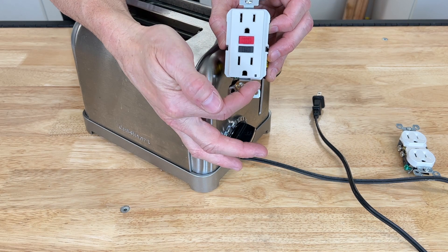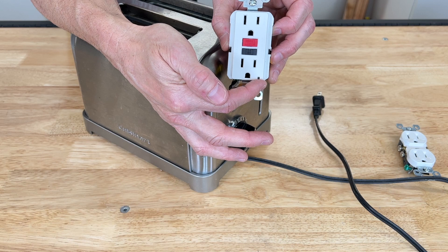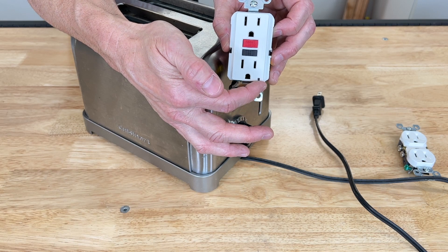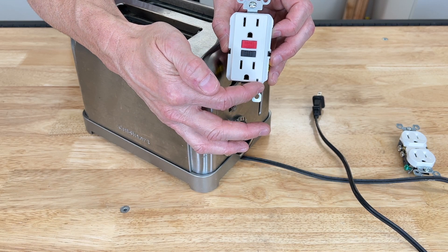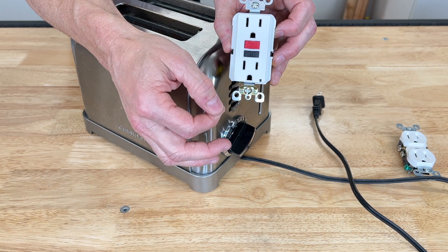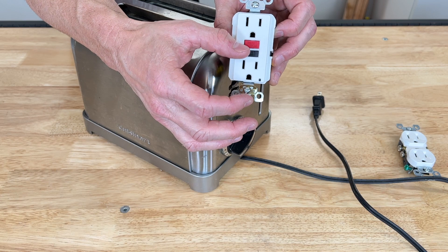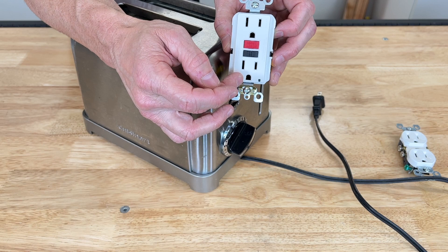This little square on the bottom corner is typically lit, but we're not connected to an electrical system right now, so there's no power and no light on it. When that light is solid green, that means the receptacle has power. If it turns red, that means it's tripped and there's no power. Also, if it trips and you unplug whatever was plugged into it, then push the reset button but it won't reset, that means it's probably faulty and needs to be replaced.